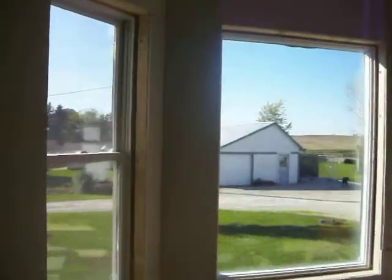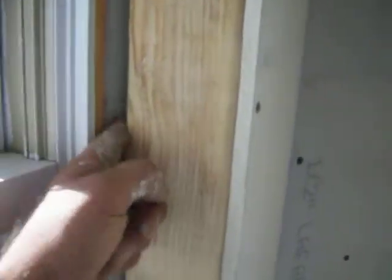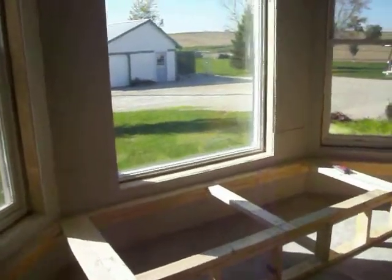We're done with the rough part of the wall. I've padded it out three and a half inches — there's a bow in the window or something here — so you can fit some insulation in here all the way around the window. It's got R13 in this wall now, which will make it a lot more comfortable in here and get rid of some drafts.